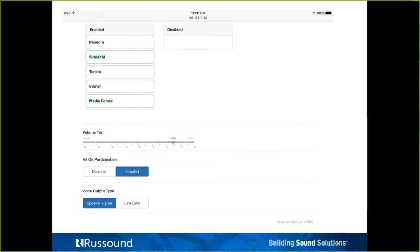Spotify Connect is something that's initiated. You're really linking up their servers with our streamer, as opposed to opening up Spotify, running a Spotify premium account on your phone, and it's coming out your phone speakers. You have Spotify's servers connected to your phone. Spotify Connect is you log into that account via the Spotify app, and then pick, in a sense like an AirPlay menu, but it's the Spotify Connect menu, a device on your network that is Spotify Connect capable. And now the streamer's servers, from Spotify, are linked up and streaming directly to the streamer. So that is why we don't have the option here.